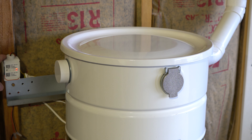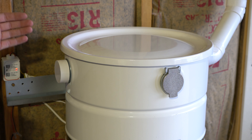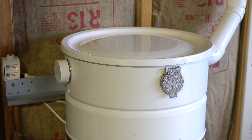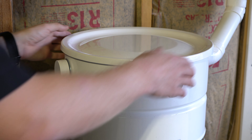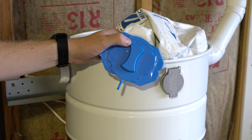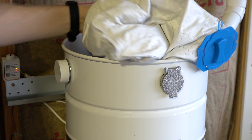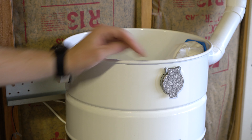This is a control box for my wireless retractable central vacuum remote — that does not come with the MD. One thing I do like is that this mounting bracket mounts to two studs, so it's very solidly on the wall, and if you need to take it off it just lifts off. Another interesting thing about MD is how you switch the intake from left to right — you should only use one side. They have a nice eight-gallon bag. It does have a problem when installed with a retractable hose: the other side that's not in use tends to wiggle open, so just put a little bit of tape over that.